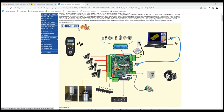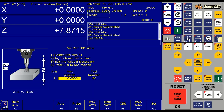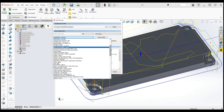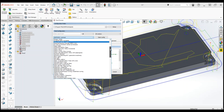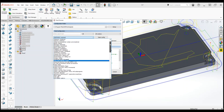The CNC controller needs a G-code file, so we need to translate all the toolpaths into G-code using a POST processor. A POST is just a translator file that turns toolpaths into G-code your CNC controller will understand. If you're buying a CNC machine, make sure you have a POST processor that'll generate G-code your controller understands. I'm running a Centroid controller, and the POST is included in the list that comes with HSMWorks. The more bells and whistles your machine has — tool changer, probe, flood coolant, spindle control, fourth axis — the more certain you'd want to be that you have the right POST.